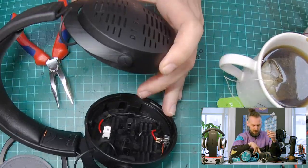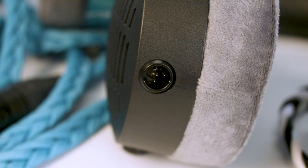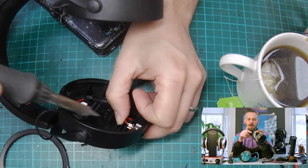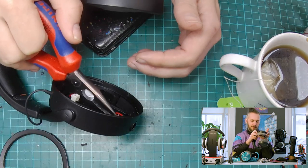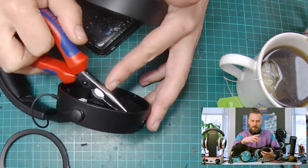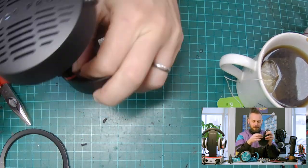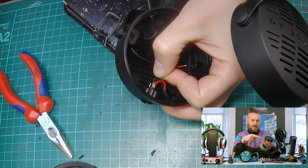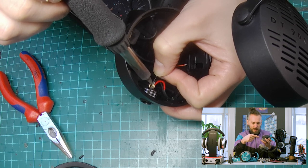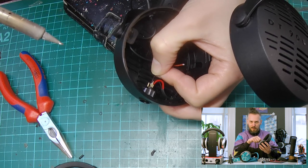We've just had some made in China which are black to match, so it goes straight in. It looks a little bit more legit with the black rather than the silver. But if you're just doing this as a DIY thing, a Rean jack will do. We will be selling them already balanced if you don't want to do it yourself. The tricky bit is putting it all back together — if you use the original headband wire that's in there, there's not quite enough length to get it outside the socket and solder it neatly. You have to put the socket in first and then solder the wires on from the inside.